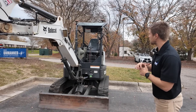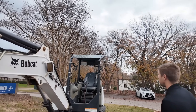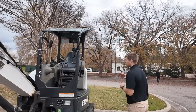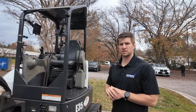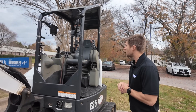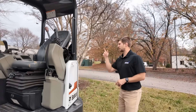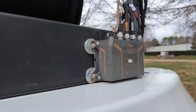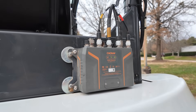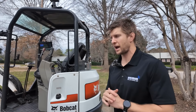The next two hardware items are the antennas on top of the cab — they track the GNSS position. One will track your fixed position and the other will track your heading, which works in conjunction with the body sensor to pick up the rotation of the machine. The next hardware component is the control box, which you can mount on magnets — it's very user-friendly to install. This system can be installed in four to six hours, so you can start around 8 a.m. and be finished by 2 in the afternoon.